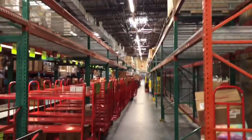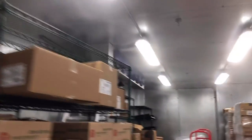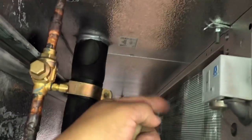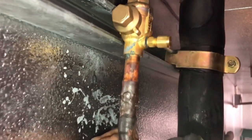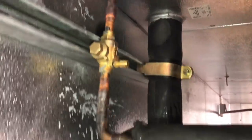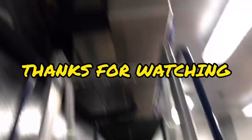You can see the line set going all the way down that way. Right now you can hear the hot gas flowing through — this is a hot gas defrost system. Hot gas comes in through the suction line, defrosts the evaporator, and comes back out the liquid line. You can feel it's definitely warm. We're not leaking, we're good to go. Just got to strap this up and that'll be it — thanks for watching, see you on the next one.